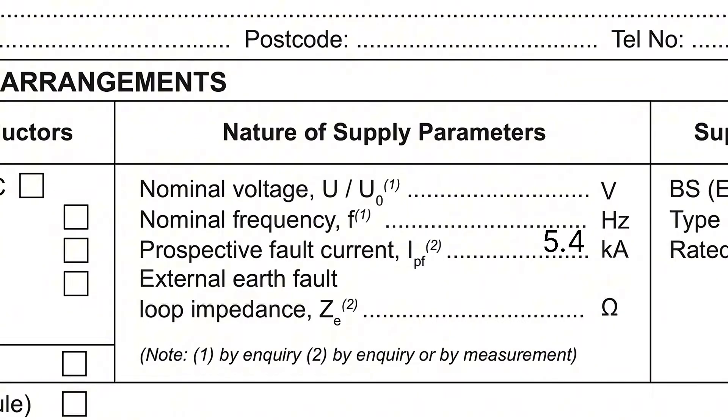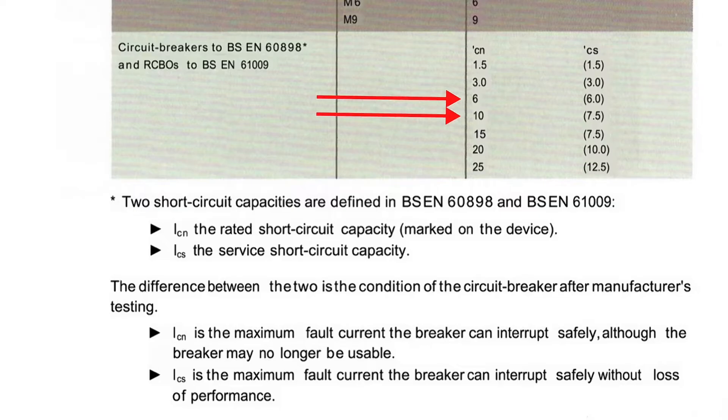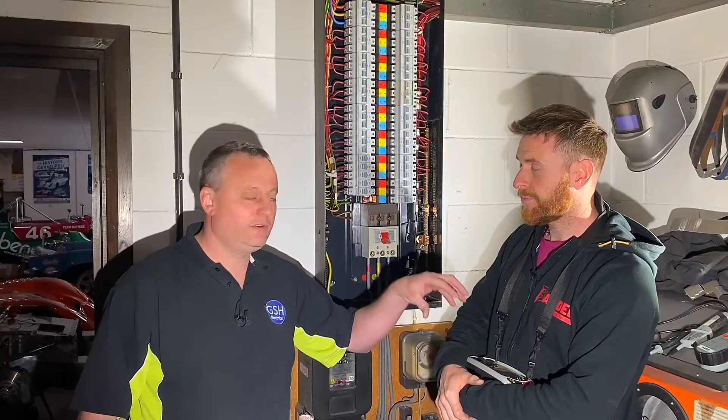And that's really important for AM2, AM2S, AM2E - that you double that number. People have actually lost marks on that - it's an easy one not to forget. Also think about the circuit breakers: they are rated at often 6kA or 10kA, so that does affect the type of circuit breaker you're using. We've looked at that in other video presentations. However, we're going to carry on a little bit further because as the AM2 and AM2S develops, your test instrument may allow you to carry out measurements between line conductors and will give you that rating.